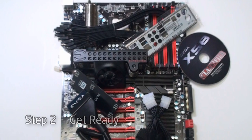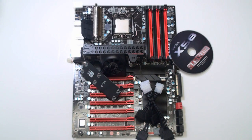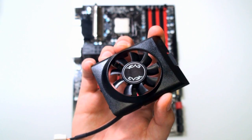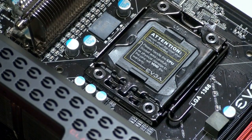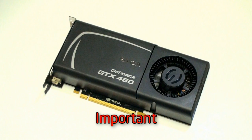Let's get your product ready to ship. Please make sure that you are sending in the bare product itself, because you'll only be getting a bare product back — so no accessories, manuals, components, or aftermarket fans and parts. For example, if you have a custom heatsink or even a removable chipset fan, don't forget to take these off before sending it in. For motherboards, reattach the CPU socket cover as well. If you have customized your EVGA product, you need to bring it back to its original state. If you send an accessorized product to EVGA, it will be declined for RMA and returned back to you.